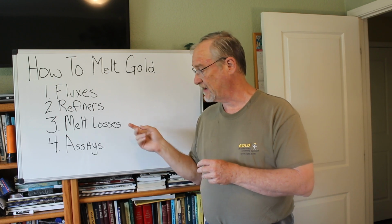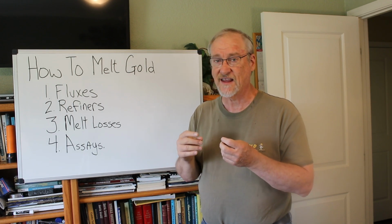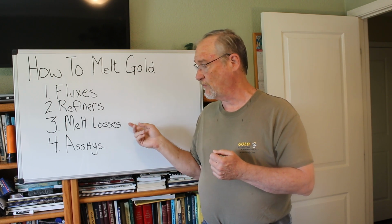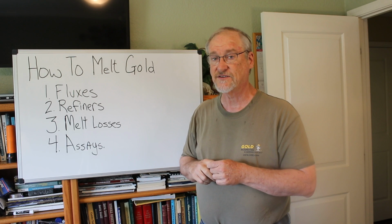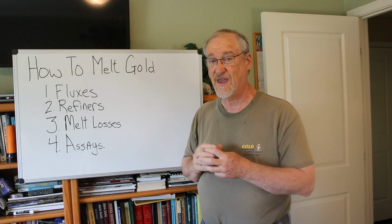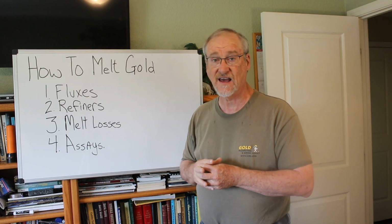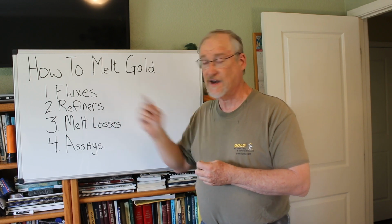One of the reasons that I do that is the topic of melt losses. What's melt losses, Chris? Well, when you have placer gold, there's probably only a certain percentage of it that is gold, and there's a certain percentage that may be a little bit of leftover black sand or quartz or some other thing. When you melt down the material to make a bar, that will be absorbed into the flux. You may have started out with 12 ounces of fines and that kind of stuff, and you may only end up with 11 or 11 and a half ounces of actual metallic gold, because the other half ounce or so, depending on how pure your concentrates are, was waste material and got absorbed into the flux.